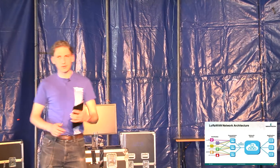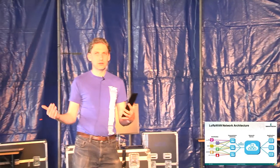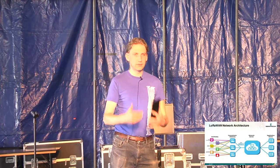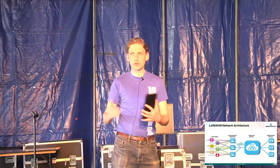Well, I sort of said data limits. There's various bits of licensing around the world. In Europe, we run it on 868. I think we're only allowed to use 1% of the spectrum. The Things Network have a restriction on top of that. They don't really enforce it at the minute, but they probably will soon. Work on the assumption that you've got up to 30 seconds worth of